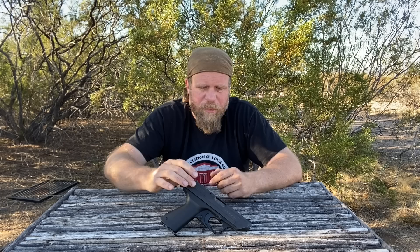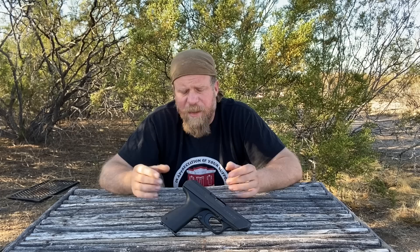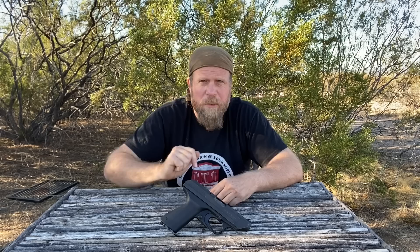At that point, the Volkspistol concept had incorporated a couple of ideas. It was a very simplistic slide that was usually folded and welded, some mass was added, and it was just a direct blowback 9mm. Direct blowback means there are no locking surfaces anywhere in the gun — not on the slide or the barrel. The only thing that keeps the gun shut and safe during the pressure generated during a cartridge detonation event is the mass of the slide and the strength of the spring.